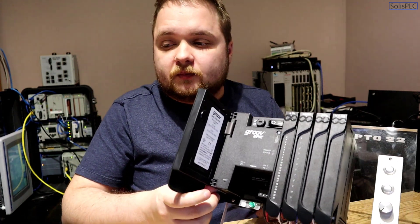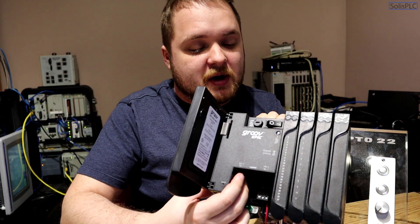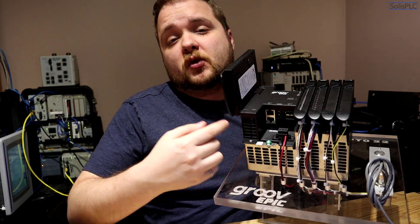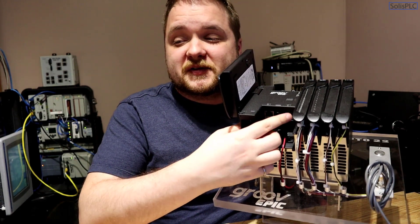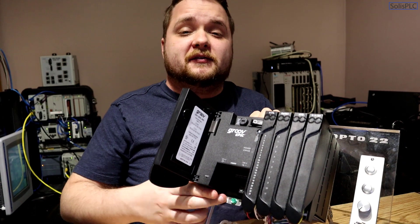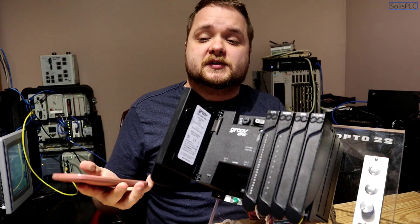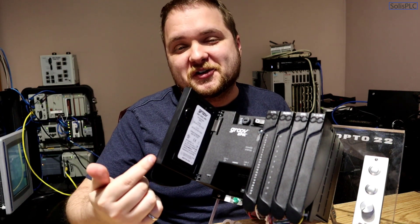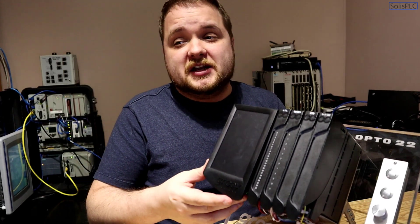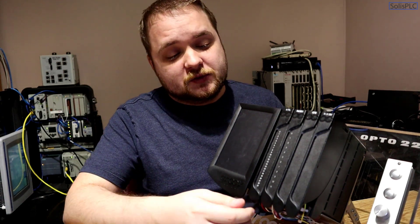When the HMI is removed, you can see the CPU. There's a power supply on the right side, and we have multiple ports accessible — two dedicated Ethernet ports. This module also supports Wi-Fi, and there are dedicated HMI ports as well. You can plug in an HMI cable and use it directly as a display screen at the plant level. You can also connect wirelessly through your phone and see the full application running on the screen through Ethernet, or do the same through your computer.